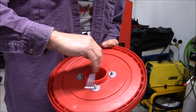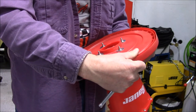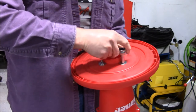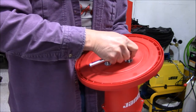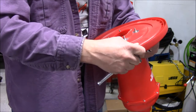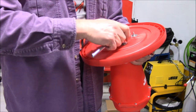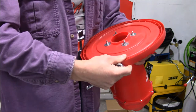Just remember, you are tightening up plastic, so don't get crazy with torquing them. It's pretty flexible. But sometimes on plastic, I see people over tighten stuff and break it, especially plastic that's more rigid. When I was an industrial mechanic, we had guards on one series of machines, and I used to put the bolts on basically snug with pink Loctite, which is a minimum of Loctite for holding value. That's all it needed. But you'd get guys who would take those guards off to change a belt or something, and they would crank them down and, I mean, they were plastic, they would break. Used to be a pet peeve of mine.